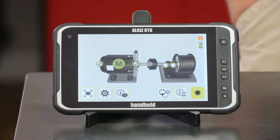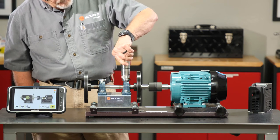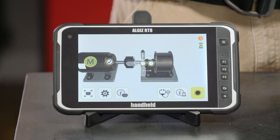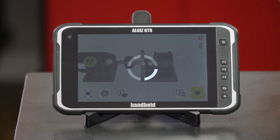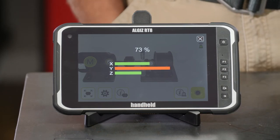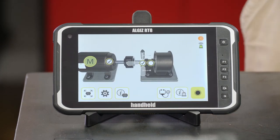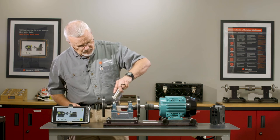That data is collected. We'll move over to the inboard fan bearing, mount the sensor, tell the RT300 where the sensor is, and collect the data. In this case we've got the Y-axis in alarm, but X and Z don't look too bad.